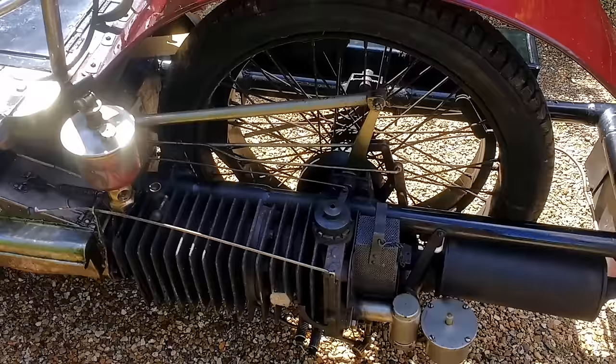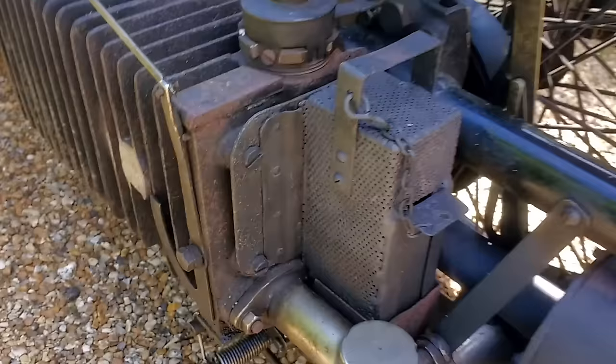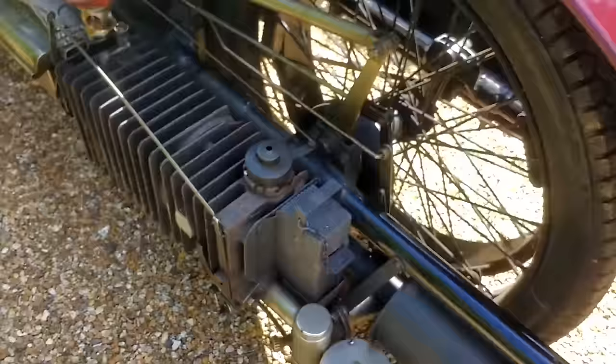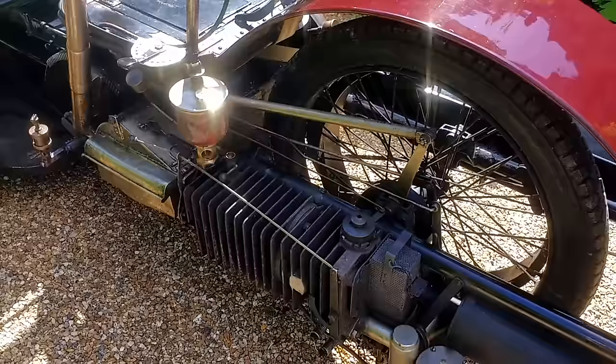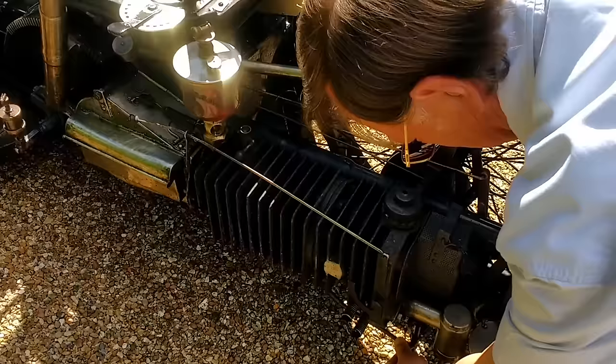And that's an 1896 — it's very, very nice. Very popular though. The flame will ring away. If you get too hot, that basically gives you an advanced ignition. Really? So that's how you would advance your ignition on one of these — you've actually got to manage the temperature. You've got to control the flow of gas to manage the temperature of the hot tube. But it's not like that in reality, it's too variable.